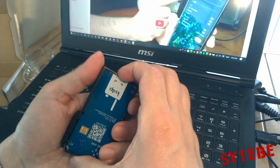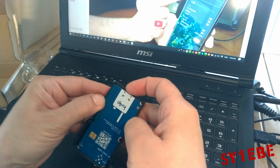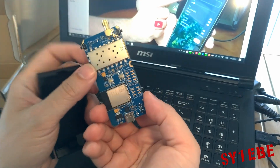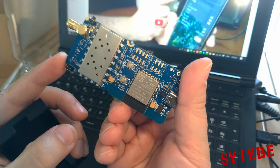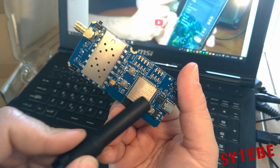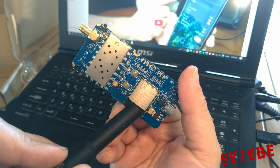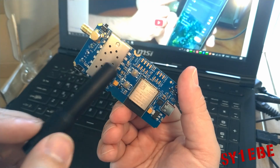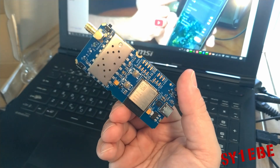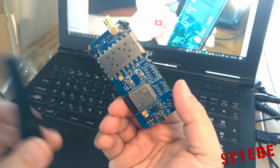There's no need for you to do this. Here's the circuit board. This is the ESP32 microcontroller — in here is the firmware that is flashed. I'll show you how it's done. This is what really does all the control of the radio — it connects to your mobile phone via Android and handles all the programming and instructions. And this is the VHF transceiver, all nicely assembled on the new circuit board. Really carefully designed, and it works amazingly.